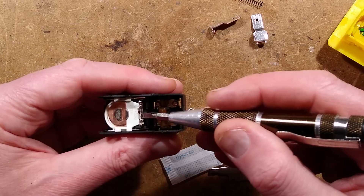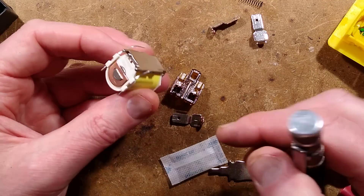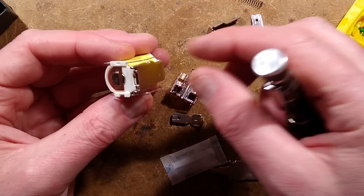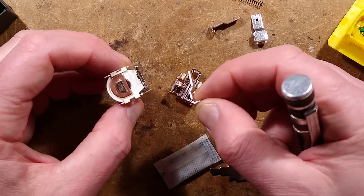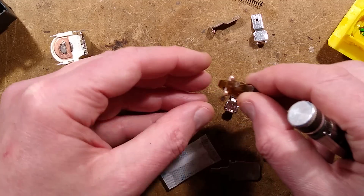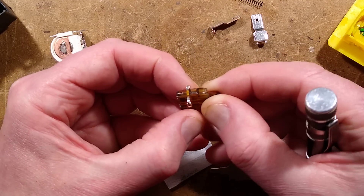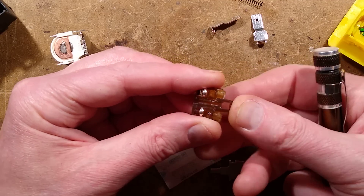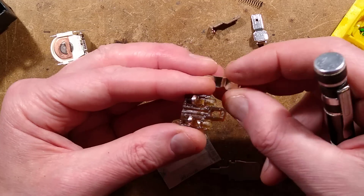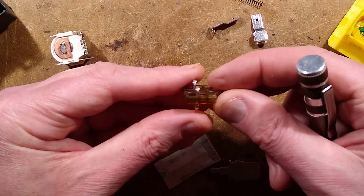And the coil - let me see if I can get this out. The coil has the two connections coming up here, and then it's got the wires bent down the side - they actually go down the side of the contacts and just basically touch against them. It's a friction fit. And here's the block with the other contacts that bridges between the two sides. It's got a spring in it to make sure that when they go up they level off and balance off. And that's the system - when you push it down it's literally going to force those contacts away from the other ones. It does mean there are actually two pairs of contacts in each path. That's quite solid.